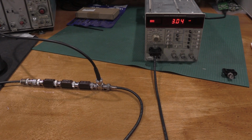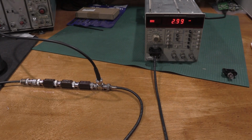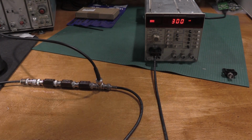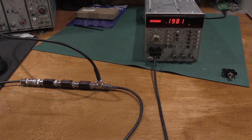Fortunately for my needs, I'm not doing distortion measurements on low distortion signals. I'm doing distortion measurements on very high volume signals because I'm testing amplifiers. So I've turned the FG501 off by just telling the oscillator it was triggered. I've adjusted the amplitude of the SG505, turning the oscillator back on, and we're going to THD plus N.